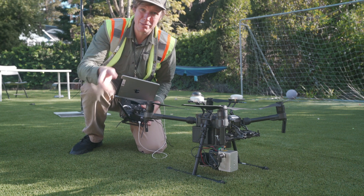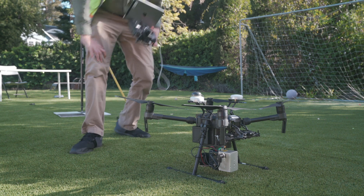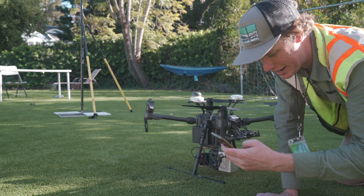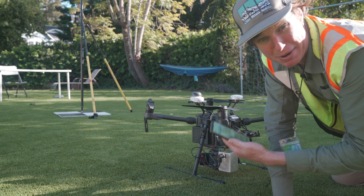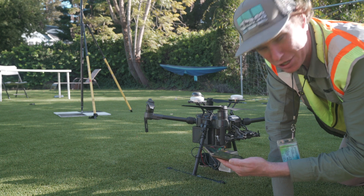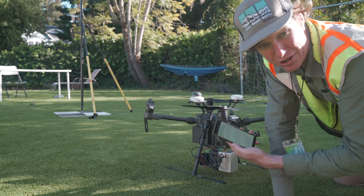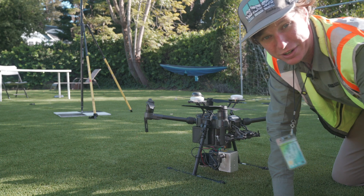We just finished flying our LiDAR mission. Now I'm going to pull out my phone and turn off the LiDAR after one minute. I'm connected into the ROK LiDAR — I come over to the app again and scroll to the bottom and click Stop. Here I can see how many pictures were taken during the flight and how much LiDAR data was captured. I scroll to the bottom and click Shut Down. Now the LiDAR is turned off and stopped capturing data. I go ahead and turn off the drone, then go to the base station and stop recording data.